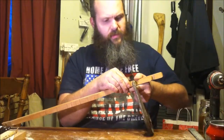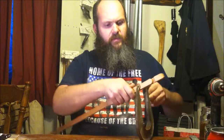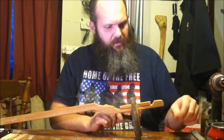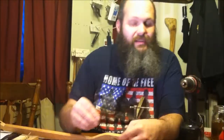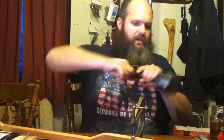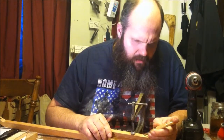I have a c-clamp, and right about now is when you wish the camera person would loan you a hand. Okay, so we got that turned over. We need to use a countersink bit from the back. This is not a hundred percent exactly what I ought to use, but it's really close and I own it. This is a number six by one inch wood screw and this is a number six by one inch countersink, so we'll take that eighth inch bit out and install the countersink.